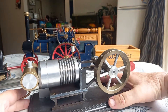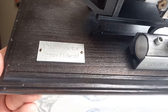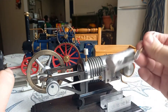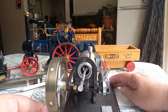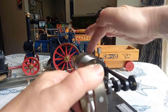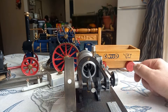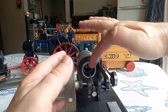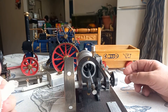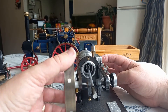Here's another German engine with issues. This is an engine by James Meivald. It's my first vacuum engine and how I adored this engine. I used to run it with graphite. It has an aluminium piston and aluminium cylinder. When I got it, you could see that all of the machining was done on CNC — you could see the machining lines going in, clear high-speed machining rings. So, not really hand-lapped or made to quality. It kept a reasonable suction, with this holding in, much better than it does now.